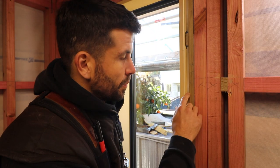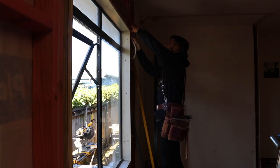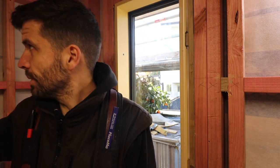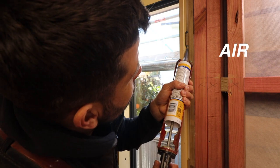The next step is to seal the inside. I've already put this perforated rod in here. In the past we used to just put expanding foam in, but lately they've gone from expanding foam to flexible sealant, so that's what we have to put in now. It's on the plan and everything — you get a nice airtight window.